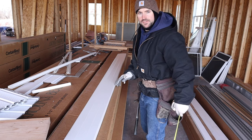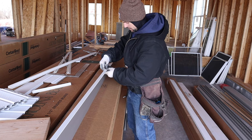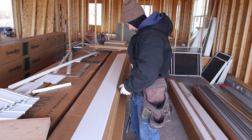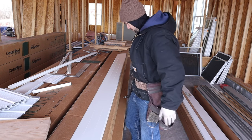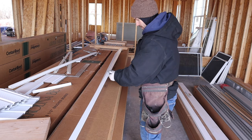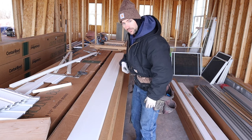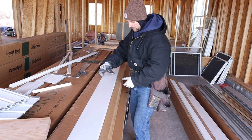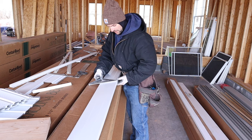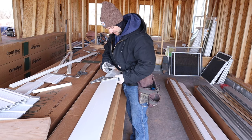This piece is going to sit right in the peak, so right where that mark is where we cut is going to be the peak. Make sure you put a nice straight line — use your speed square, I highly recommend it — and make that cut. Now you do not put your 7/12 to that edge. Instead, extend the face up the peak a little bit: put a 7/12 but slide it up about a half inch to an inch from that edge.